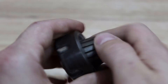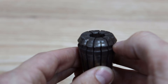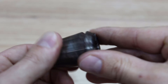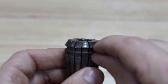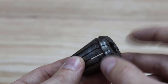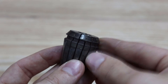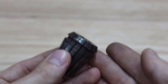Another thing I didn't know when I was first starting out is that this collet eventually will get deep scratches in it. If it gets deep scratches, it's going to wobble inside that spindle and that's very bad. Deep scratches mean this collet was spinning without being properly tightened down — it was spinning with the bit and formed scratches. If it has scratches all the way around, throw that away. It's now a bad collet and you need to get a new one. That seems costly, but it will improve your bit life and improve your cuts.